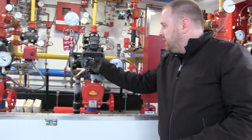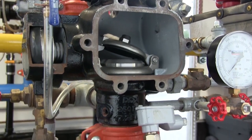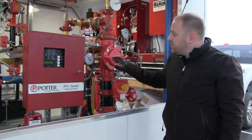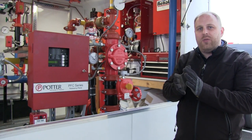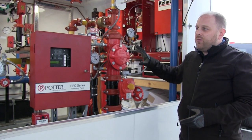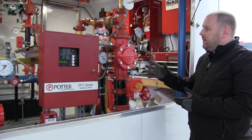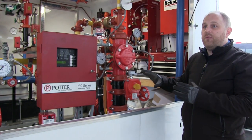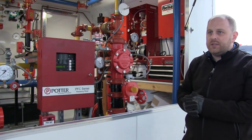So you can do some things that we normally could not do with our DDX valve. The DDX valve, once it trips, latches in the open position and we lose that ability to push a button and reset the valve. One other thing to know about the DDV is that we have the ability to regulate how much pressure is relieved off the diaphragm. There's a pilot valve located on the back of the trim, and if we don't allow that diaphragm to fully deflate — if we keep it only open half of the way — we will lose a significant amount of pressure as we try and push water through the valve. So this valve can be a deluge valve that can reduce pressure, and that's something you can't do with our DDX technology. We will also be able to offer this valve without the deluge capabilities to focus on simply reducing pressure.